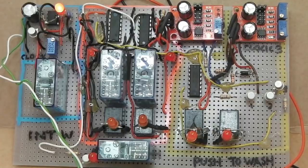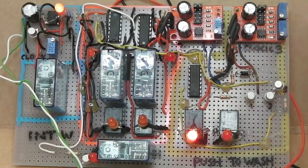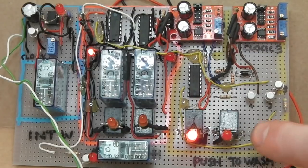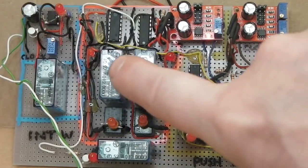I've actually not soldered the wire in. It requires an input and an injection 12 volts here. Watch it go, lock on, circuit locked. It's already begun counting now because I've pulled the wire off. And see, about 6 seconds before it drops into the kill out relay here. There it goes, knocks the circuit out. That relay would have activated.